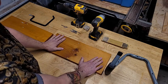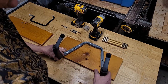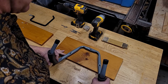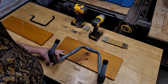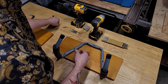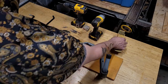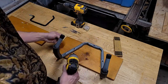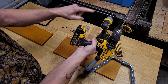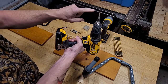So we get our brackets and mount them to the wood. I have this positioned so it hangs down below just a little, so this part is hidden up behind the tuba. I'm using these screws - inch and a quarter - and I pre-drill my holes using a countersink bit, but you can just use a regular drill bit.